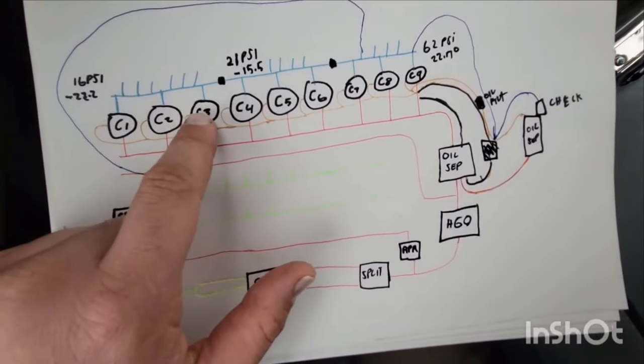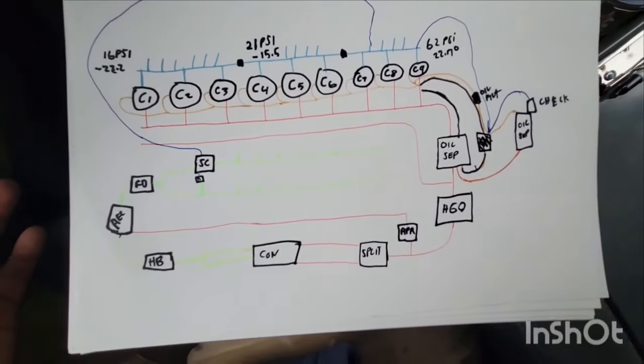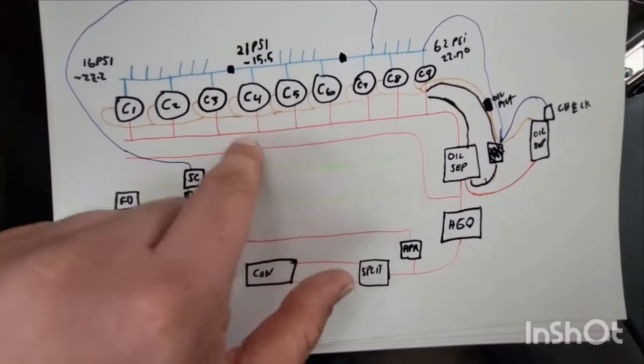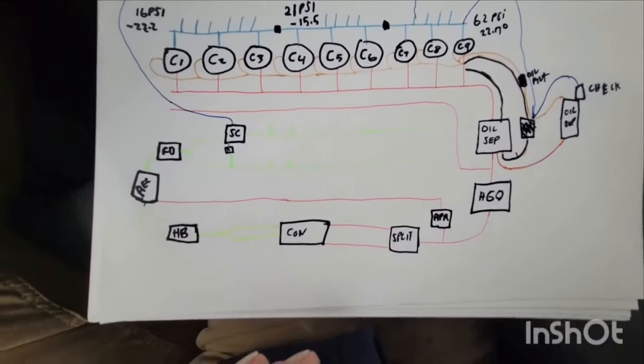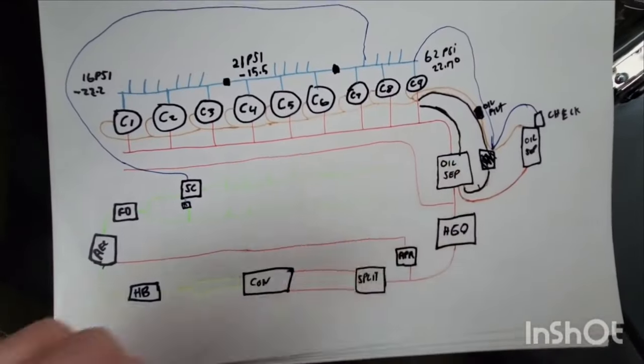But a compressor could have been off on high discharge because earlier in the day it was like 100 degrees out. Could be all kinds of things. Could one of those safeties be locking the compressor out even though it shouldn't be? So the safety's bad, right? So evaluating whether all the compressors are running is your first step.